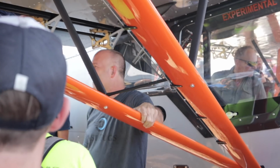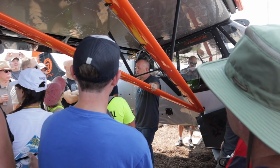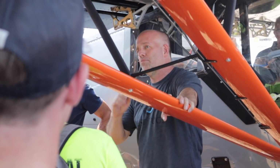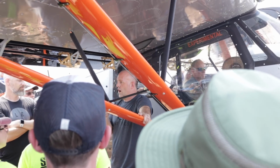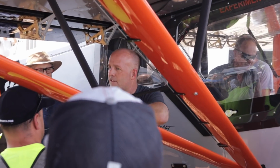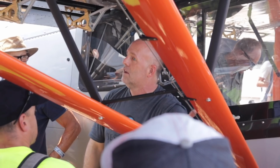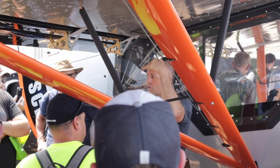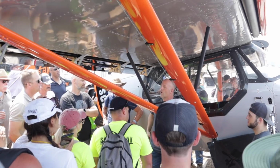So with the solar, how many watts of solar? I have 900 watts of solar, eight batteries, four lithium per wing. The plane produces enough power that if I had a dual alternator failure, I switch one switch and my solar can run. I don't have to shed any load. I can leave all avionics running, all systems, all fuel pumps, still be charging my battery, fly into the night if I was crossing an ocean, and then the solar would quit and the battery will take me 10 hours with all systems on. So over 10 hours.